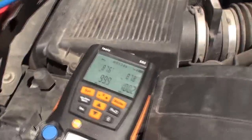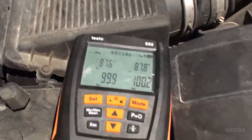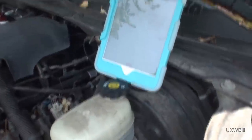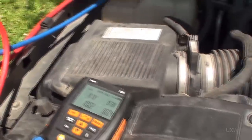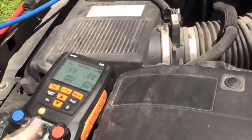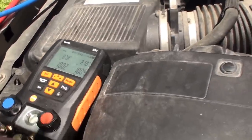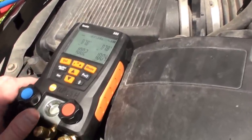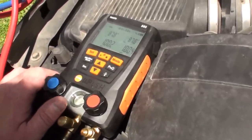The good news is that the system is definitely still under pressure, just like it's supposed to be. Both sides are basically at the same equalized pressure because it's not doing anything now. Even a part-time HVAC guy like myself doing this as a sideline needs all the toys. There's our Testo app showing readings from the 550 digital manifold. I actually saw an older gentleman with the 549 — the model without Bluetooth — and was immediately taken by it. These things are worth the money. I still have my analog gauges and prefer them for situations like burnouts or compressor failures, but for everyday service work this thing is great. I would buy it again in a heartbeat.